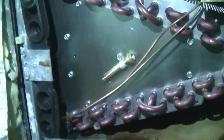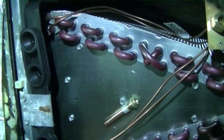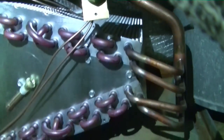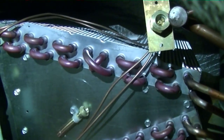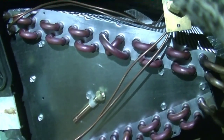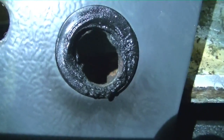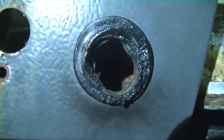Here's our Goodman coil, a new one all in place. I'll put a little strap on it as well — there's a little groove it fits into in the back. I don't think the other coil was fitting into it because when I took the strap off it fell down. If you don't put it in the groove in the back, air will just rush around the back side and it will not be cooled. This is a copper coil — most of the older Goodman air handler coils are still made as copper coils. This will be the third coil that's been in this particular air handler. You can always tell what kind of attention was paid whenever you come back on a job like this — instead of removing the rubber gasket, they just brazed it in place, melted it, and burned the cabinet. You be the judge, YouTube.